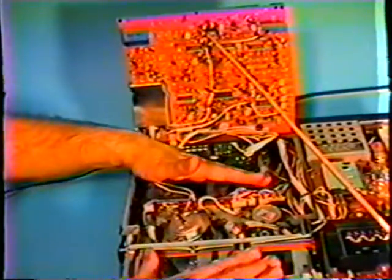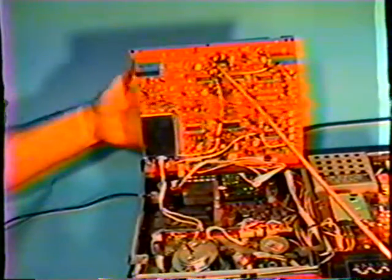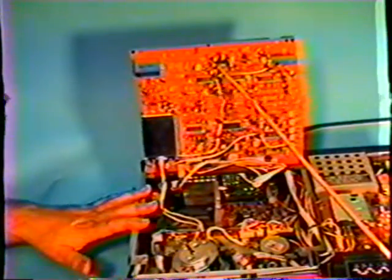Some of these machines, the boards are very heavy, some are pretty light. Some don't even have these boards here. They're exposed just like this. Ken, does that board have a stop behind it so it doesn't flip all the way back? No, the wires tend to keep it from going all the way back. Okay, so you have to be careful with that. Also, this board does have a plastic fiber protector on it because there is a metal bracket way in the back here. Some of the machines do not have a plastic fiber, and if you run into that, you have to be careful that you don't open it up to touch the metal when you do have the machine plugged in and running.